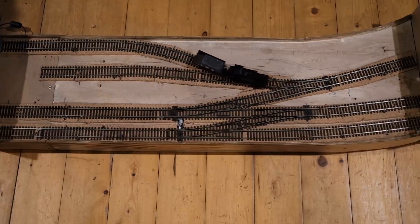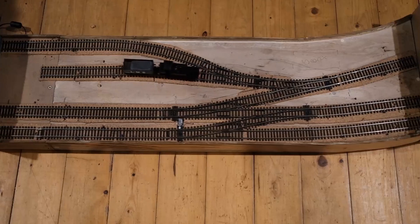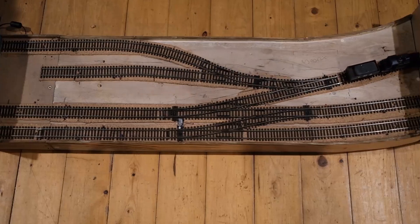While designing this, it's difficult to decide on the timing. It's using a simple shuttle — one of Davey Dick's simple shuttles. What you do is control the polarity of the voltage going to the track, and you have diodes at each end. As you reverse the power to the track, the train will wait until it's enabled through the diode and then work its way backwards and forwards. It's a balance between not going too fast and being fast enough so that you don't lose the will to live while watching it.